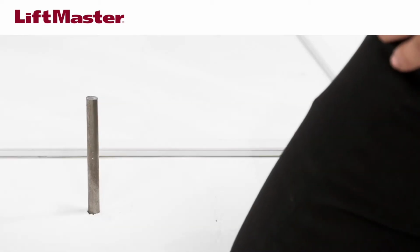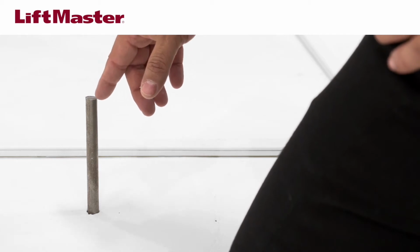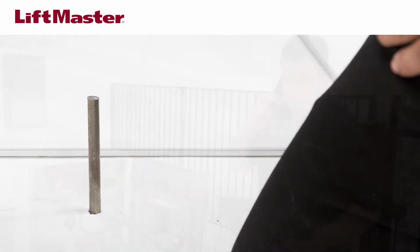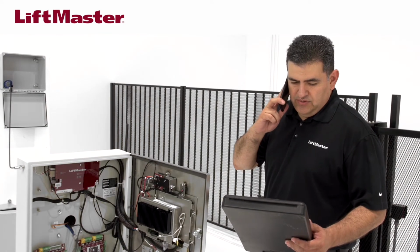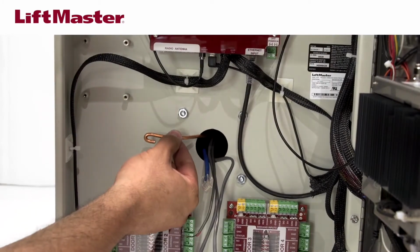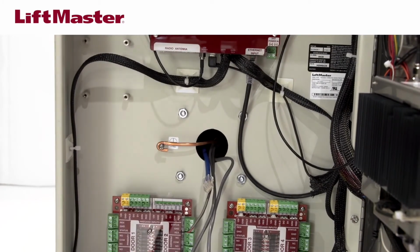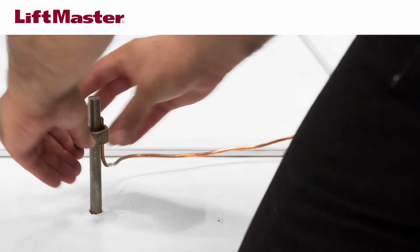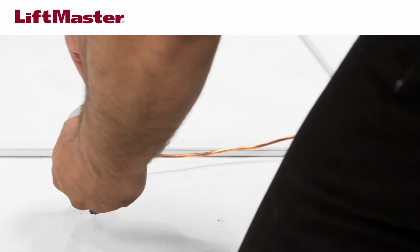An earth ground rod is strongly recommended and should be no further than 12 feet from the CAPXL and use a minimum of 12-gauge wire in most cases. A proper ground is critical to minimizing the risk for the CAPXL from damaging electrical transients. Be sure to check and follow all national and local codes for proper grounding procedures. Connect the ground wire to the CAPXL main earth ground connection. Run the wire from the CAPXL to a suitable earth ground.